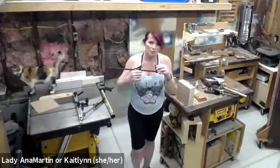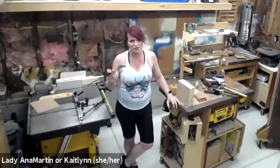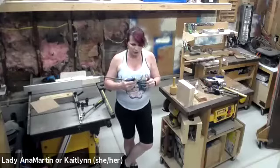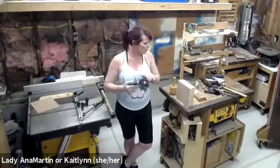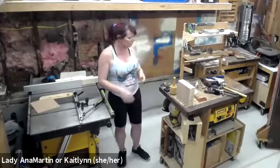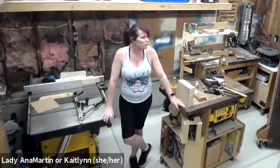These type of quick clamps are wonderful. Irwin is the go-to company for these. They open and close very quickly and then use the trigger to clamp them down. A selection of these is great for projects basically about the size of this workbench. Bigger than that, you want a pipe clamp or a K-body clamp.